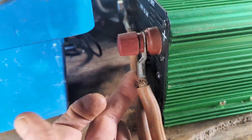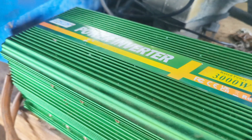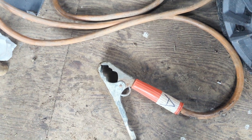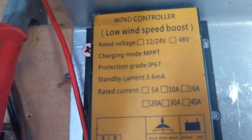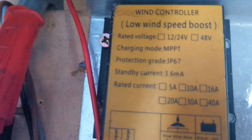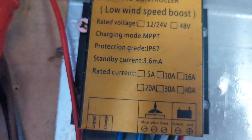I've got some very hefty jump leads to go on, they're about six feet long, so that's how we're going to be taking out all the juice — and the wind's just started howling right on time. So yeah, this inverter will be plugged into the two batteries via the cable ends and that is how we'll be getting rid of all the power. That brake will still come on at 28 volts so it's all about timing really. We're just going to have to see how it works, and when my son gets around here it's going to get put up and from then on it will be running like this with the new gear on, so I'll do a live stream if it starts turning.